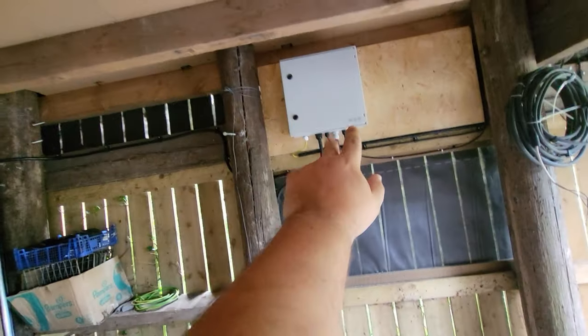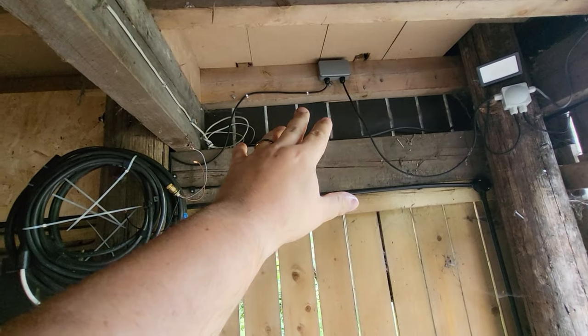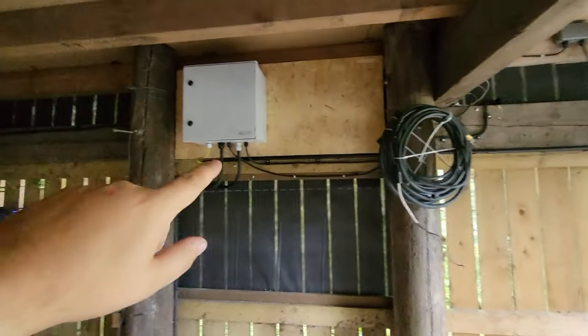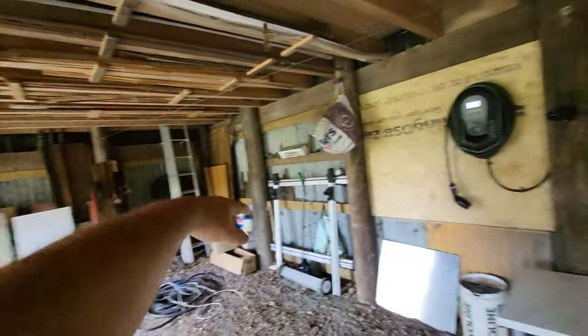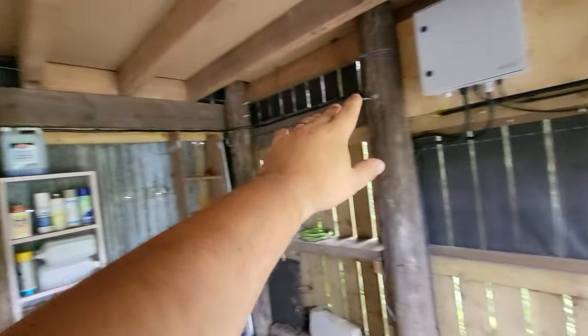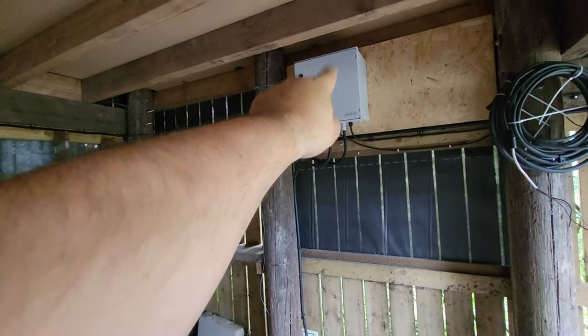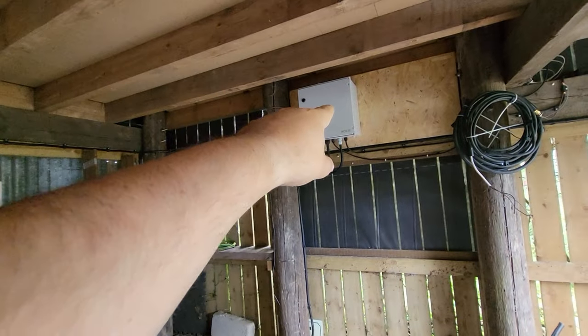We're all buttoned up here. These final circuits have just been loosely connected into existing junction boxes. Again, customers rewiring all down here, so it's all coming out. But for the minute, they've got power basically to these lighting circuits so they can see, and a power socket that is over in that side just temporarily. Our new EV comes away on the steel wire armor, sorry, the EV Ultra, and goes into our 30 milliamp RCBO within this board. So we're all covered and protected, everything's powered. We've got a little heater in there, as we showed before. Our earth rod's on, down into this nice earth pit that Matt has dressed in.